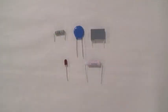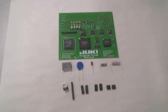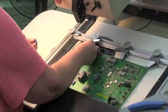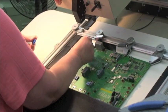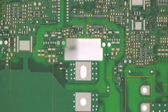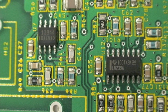Each circuit board is made up of passive components, such as resistors and capacitors, and the more complex integrated circuits, or ICs. Components can be one of two types: surface mount or through-hole. Through-hole components have long leads that are connected to a circuit board by inserting and soldering them into pre-punched holes on a PCB. Because of decreasing size requirements, almost all circuit boards use surface mount over through-hole components. In this video, we will take a look at the manufacturing process of surface mount boards.